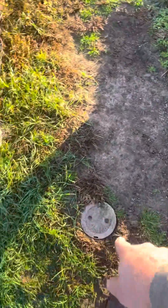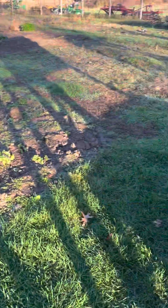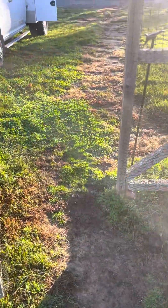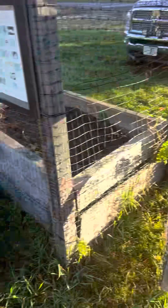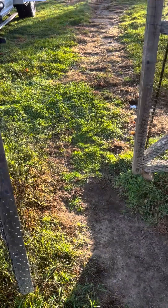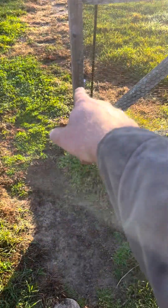Make sure this valve is open. Go around and open all of the faucets. Leave them open for the winter. When you come in the springtime, the water department will turn on the water service and water will flow out the faucets. There's nothing to be turned back on on this property — everything should be left in the on position, including that valve.